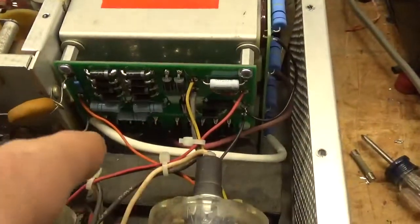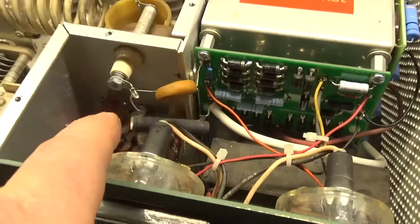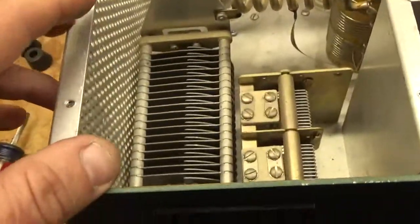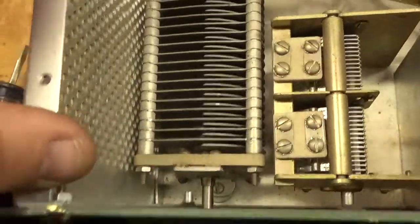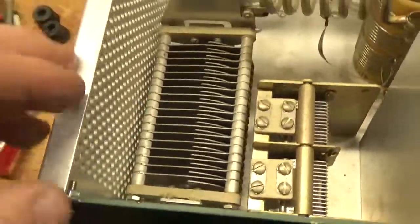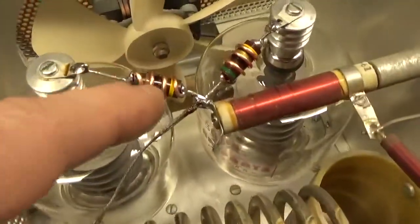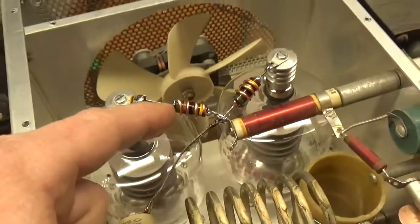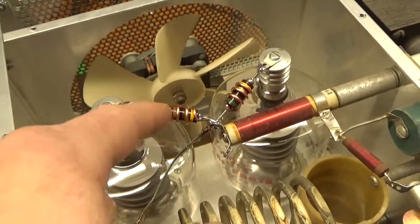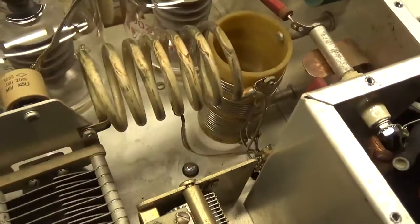I placed the high voltage lead, meter lamps, put the series glitch resistor in. Plate-tuned cap was loose — that's this cap right here — the connections to ground were loose. Changed the plate-blocking cap, put in brand new 2-watt 50-ohm carbon-comp resistors, rewound them, new copper.